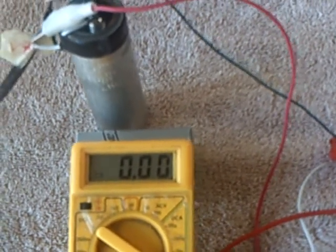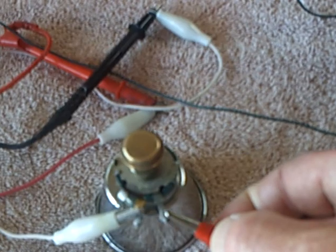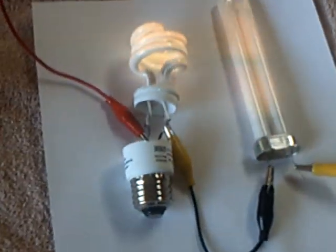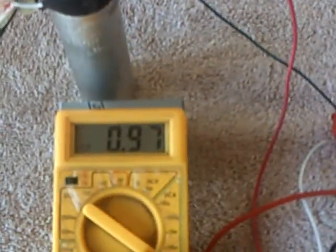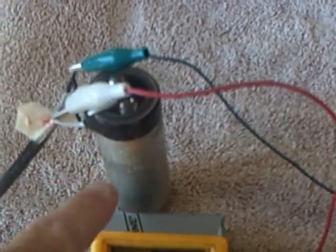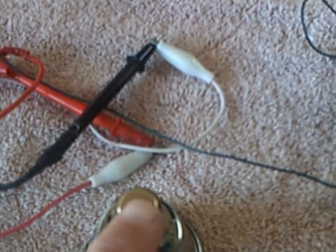There's the amp meter draw on it — when I turn this on you'll see it. I'm using a rheostat again. There are the two bulbs being lit. I'm drawing on the system about an amp, storing up some of the energy between the pulses in the big capacitor. I've got the rheostat set for about an amp draw.